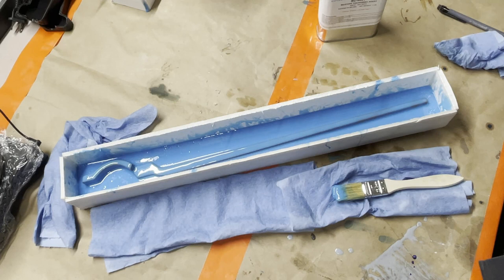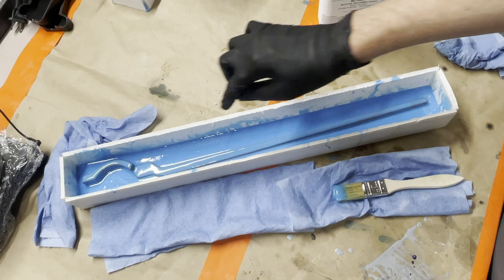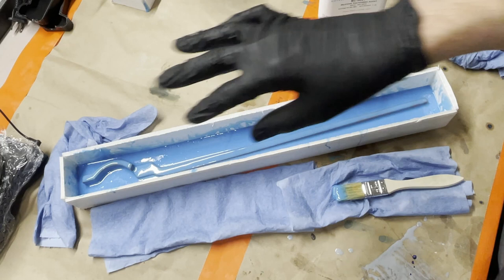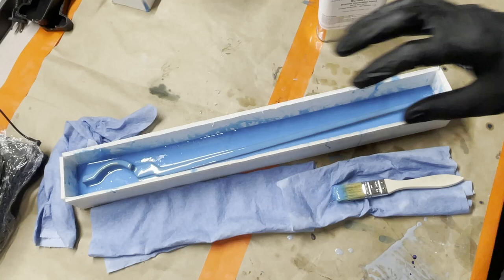And then we'll have a nice shell that holds the silicone perfectly straight, and we can pour the resin from the other side. Well, the next step after all the silicone is cured is I'm actually going to leave it in here, just because it's easier than trying to do it ahead of time. I'm going to cut keys through the silicone, through the clay, while it's in the box, and then brush on the BR75D, and what that does is it'll give keys where the silicone and the rigid shell lock together. We'll also put some keys on top of the second layer of silicone.